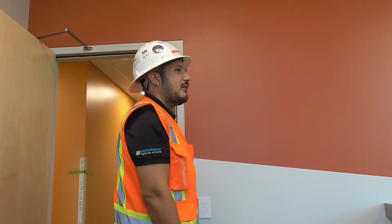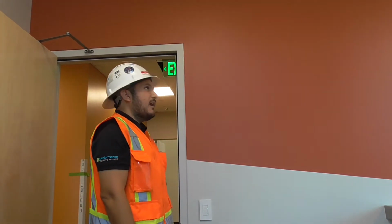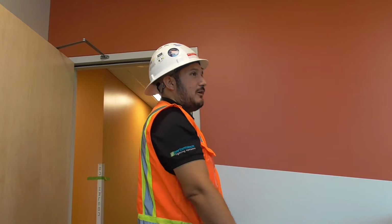So that'll be the difference. Like I said, for troubleshooting purposes, if you come in the room and the lights don't come on automatically, that's a complaint you guys might get. Hit the switch. Do the lights come on and off? Do they raise and lower?